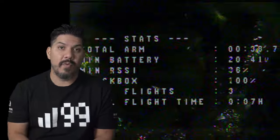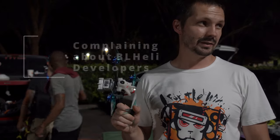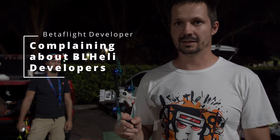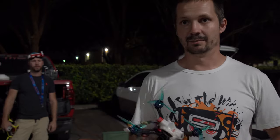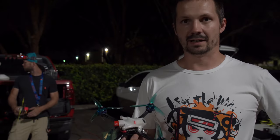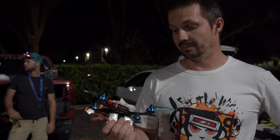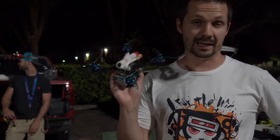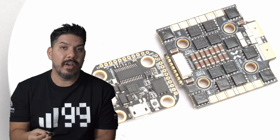I'll have links to all this stuff in the description below. One thing I don't like about this ESC is that it only officially supports BLHeli_32 version 32.8, but you can go to GitHub BLHeli_32 and download version 32.7 and downgrade it, because currently 32.8 is more noisy — there's some bug. Hopefully they'll fix it in 32.9, but I'm downgrading to 32.7. I don't use variable RPMs, but overall I like it — this is good.